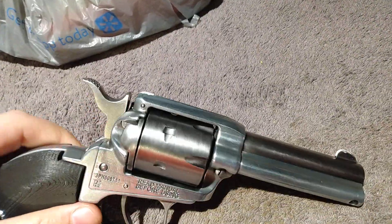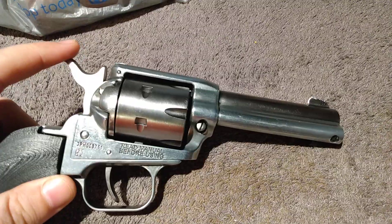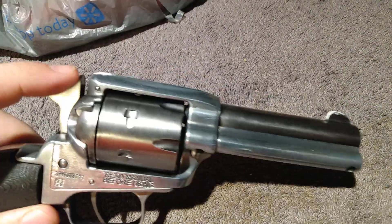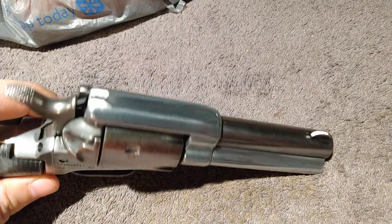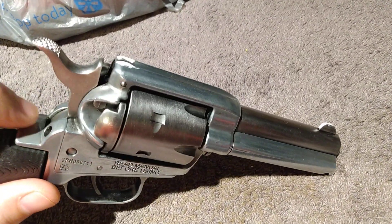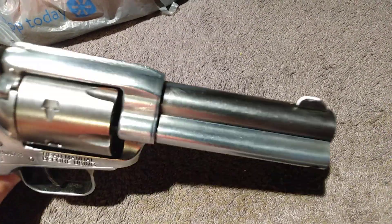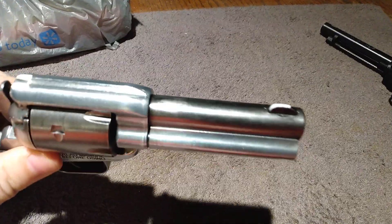After the sandpaper was done, I hit it with some more steel wool — four-aught steel wool, which is pretty fine and won't scuff up your barrel. After that I looked it over and wiped it down, and still wasn't entirely satisfied, so I took my Dremel to certain spots and tried to shine it up as much as I could.